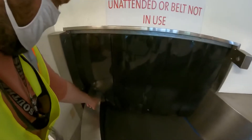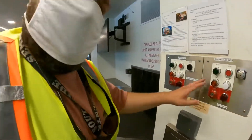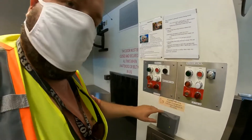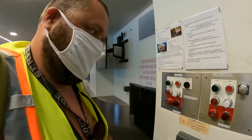There's also a sensor and reflector down low. If a bag gets jammed at the down-low reflector, then we're going to hit the e-stop, hit jam reset, and then hit start. So you've got an extra step on the ticket counter units.